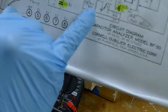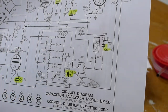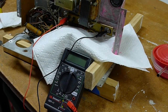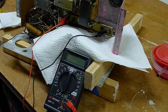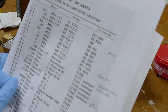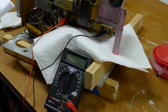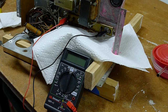is a whole other resistor altogether. R11 down here is not part of the bar. R10 is the bar, which comprises these 4 resistors. So anyway, my confusion is settled. Now, the total resistance on the bar, I believe, was 45K. R10, 45K ohms, tapped 4. 10 plus 10, it looks like it may be a 5. 4 times 10 is 40, and then a 5. So 1, 2, 3, 4. Yeah, there are 5 connectors on it. Maybe I am still confused, but no, not anymore.